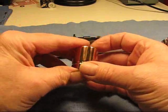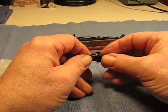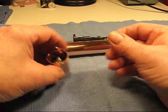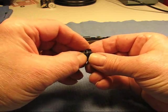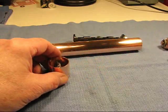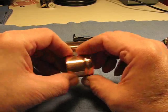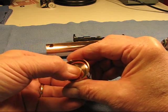The tail cap itself is a little different — I decided to use a McClickie. I had a couple sent to me by a friend and wanted to try one out. The best thing I could come up with was a half-inch copper coupling, which has a slightly smaller ID than the OD of the McClickie. I took the McClickie apart, sanded down the threads so it would press-fit tight inside that half-inch copper coupling, then cut the coupling to the right height so the metal contact plate would touch the copper coupling. I soldered the coupling in, drilled my holes, and pressed the McClickie right through using a tall socket. It works pretty good.